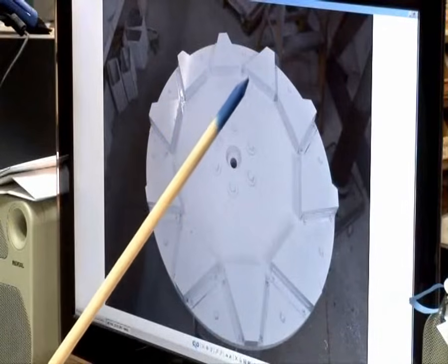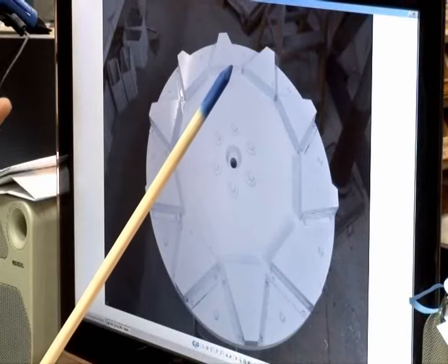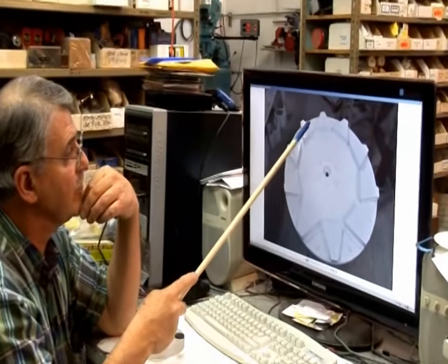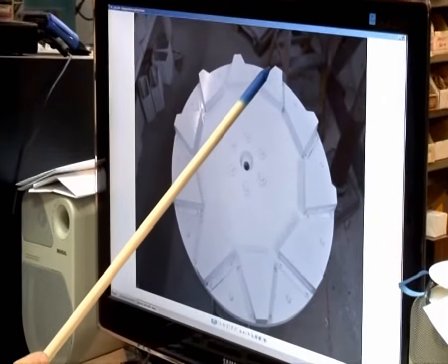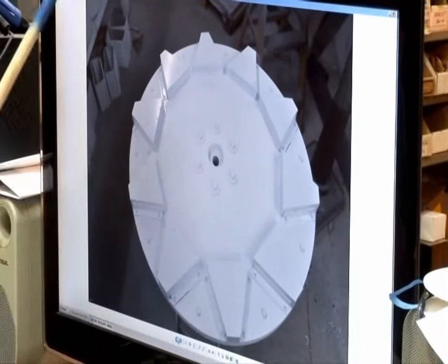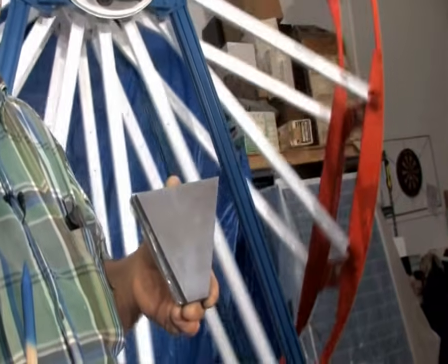Okay, so we've seen the mounting side of the magnetic coils, which are basically being wound around the magnets, but with coils that couple through the iron. So again, what you're looking at here is the shape of the magnets. It's this shape because we only need this much arc. And I had them cut years ago to make this type of motor. All right, so these are barium ferrite magnets. They've just been painted. I held one of them up for you and showed you that they rust.